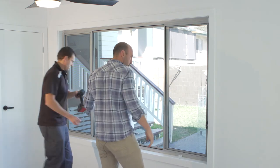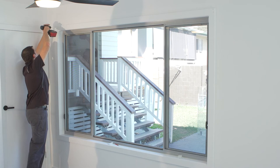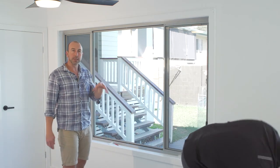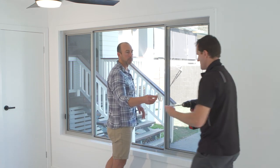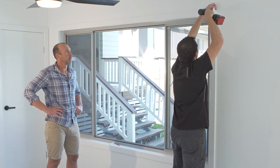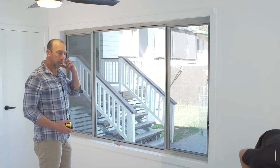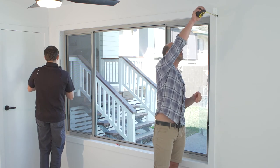Darren will pre-drill that side. Then he's going to change his drill bit and put a Phillips head driver in so we can screw the screws in. As Darren's screwing the pin end in, I'll just show you — that's a face-mounted bracket, so it does sit out. Our bracket from front to back is sitting out 70mm. So you've got to understand: that's an inside mount, and now we're installing the outside mount.